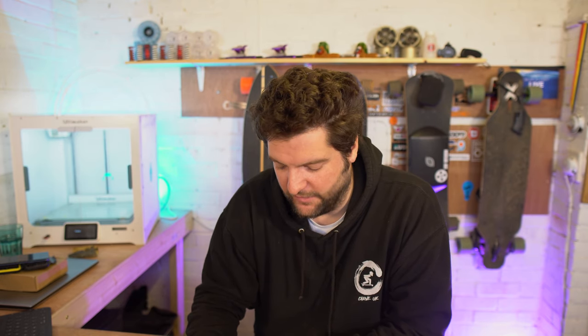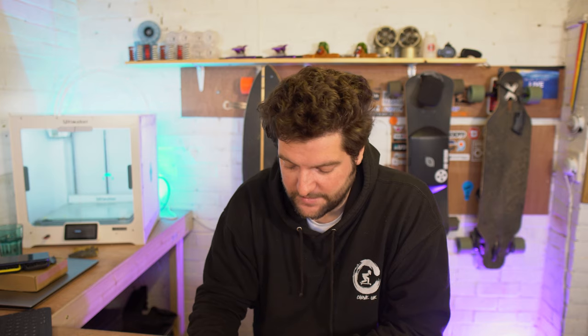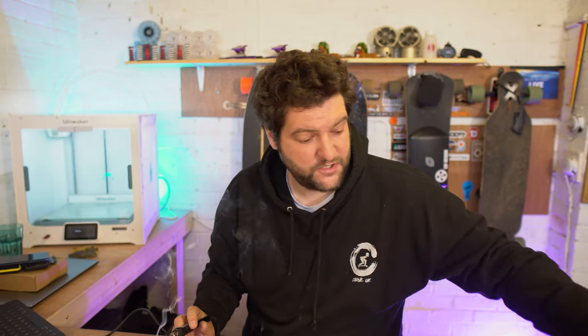Now, one other good tip is with the terminals that you're going to solder onto, use a little bit of sandpaper and just give that nickel a bit of a roughing on the surface. It makes the solder stick so much better. Some solder on the terminal and then attach the two together.